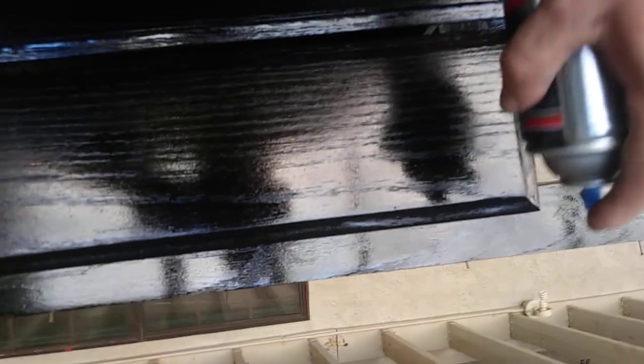That's why we went in both directions, alright? And I sprayed the poly. I went vertical, then I went across. So I went across the grain. That way it catches, fills those hollow spots in the grain. Now for the doors, I'm going to catch this horizontal first. Okay, catch the bottom.